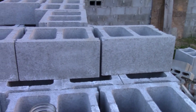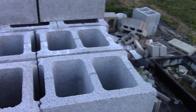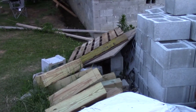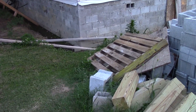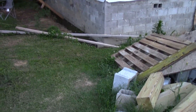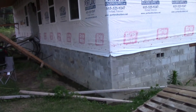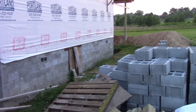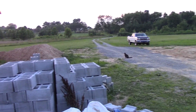I've also got to load up all the leftover 12-inch block from the foundation, take them back, and swap them out for 8-inch blocks. Then we'll start laying them down on the remainder of the footer and use the 8-inch block to get up to where ground level is going to be and break from there. So we're getting there, slowly but surely. Thanks for watching and stay tuned for next time — bye!